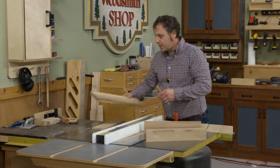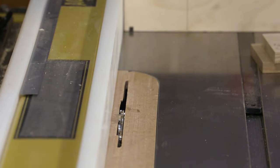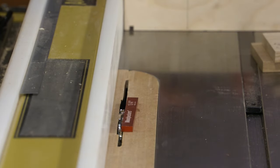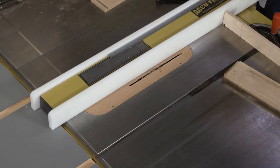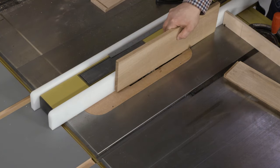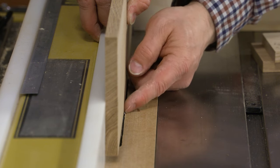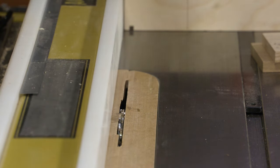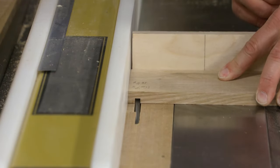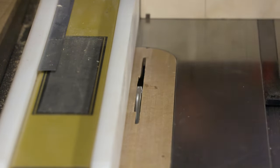To get started I'll cut the dado first. I have a quarter-inch wide dado installed in the table saw, raised to about a quarter inch — roughly half the thickness of the workpieces. The rip fence is positioned so that the inside edge of the dado will be on the inside face of the two end pieces. I'm using the workpiece as a guide, feeling with my fingertip that the outside edge of the tooth is flush with that face. I'll cut dados on each end of both front and back pieces, and keep this setup for the groove that holds the tray bottom.